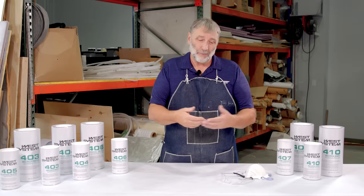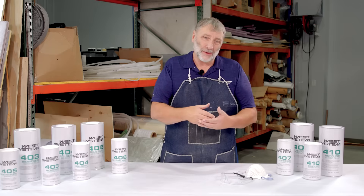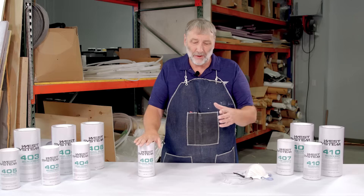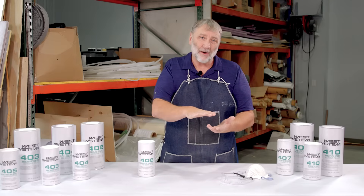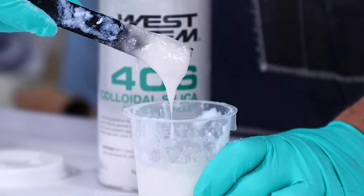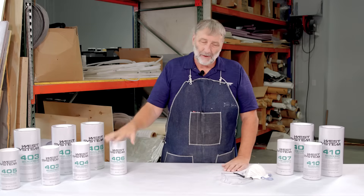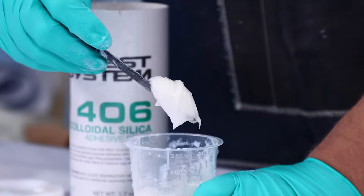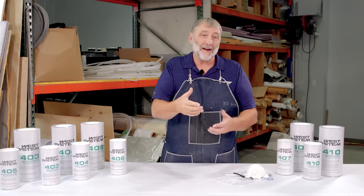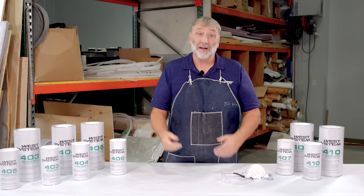What do I mean by consistency? Epoxy when it comes out of our cans is what we call neat epoxy — there aren't any fillers in it, it's unthickened. If you add a little bit of 406 you can get to a ketchup consistency — it's going to be a little runny; if you put it on a surface it'll kind of flatten back out. The next level is mayonnaise — a little bit thicker, it starts to stand up on its own but still kind of slumps down slowly. The final one is peanut butter consistency — nice and thick; when you mix it up in your cup you'll see these little mountains that stay there and won't slump back down. That's our way of determining what kind of consistency you need for the application you want to do.